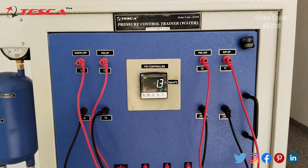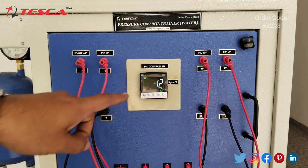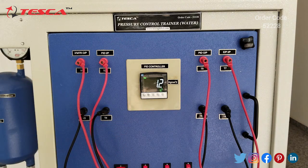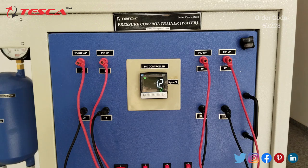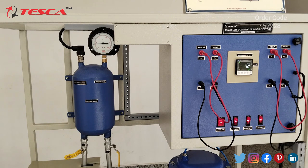Here you can see that as the PV reading increased above 1.2, it again got balanced. The PID will maintain the PV pressure. That is how you can perform this experiment. On the pressure gauge you can see 1.2 balanced by the PID automatically, and here also you will get 1.2. The PID controller is automatically balancing the pressure and we have partially opened valve V6. That is how you can perform this experiment.